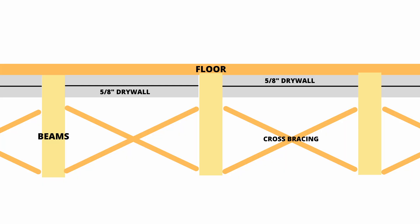What we're going to do is take five-eighths-inch layers of drywall and put two — maybe even three, as many as you can get away with — in between the rafters of your floor. Because the more mass you have, the more likely you're going to reduce sound coming through your floor into your studio, which is the biggest problem with a basement studio. We're actually going to install the drywall pieces with green glue in between them underneath the rafters. Below that, you're going to put regular R-13 insulation — cheap pink insulation works fine; you don't need rock wool, it's kind of a waste of money here.